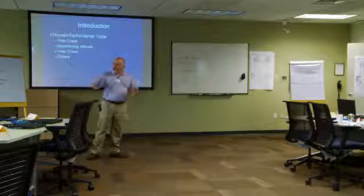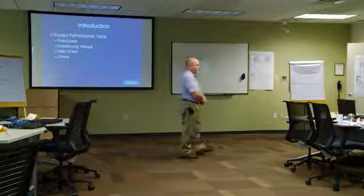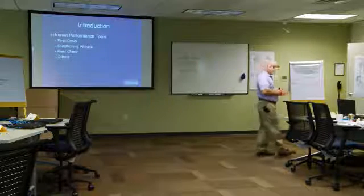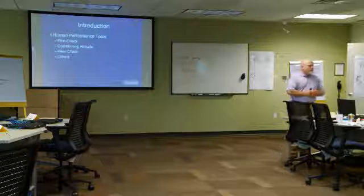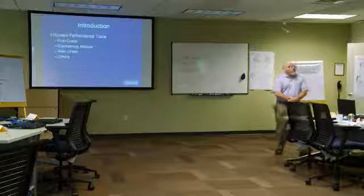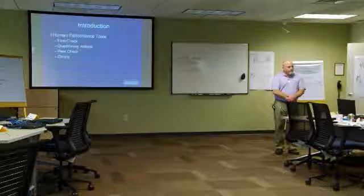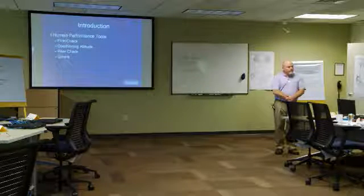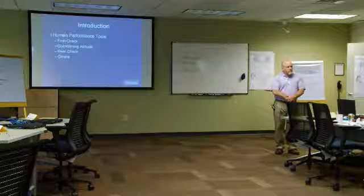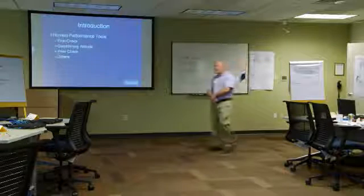So Steve kind of generalized it, but thinking about putting a safety ground on, what are some specific things we might want to question? Dave, any thoughts? Well, yeah, I'd always be questioning, am I using the right type of grounding device? Is this a good ground to go to? Am I actually going to live voltage rather than the ground? And actually first check that I'm even on the right equipment in the first place, with permission to do the work. Excellent, excellent.